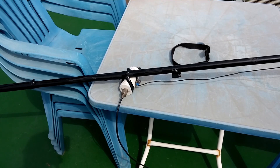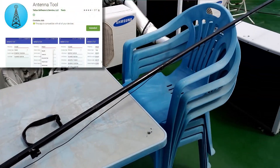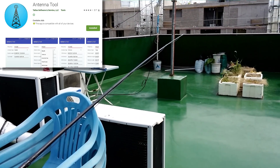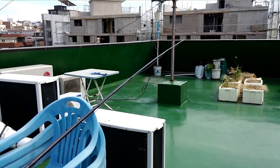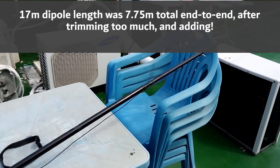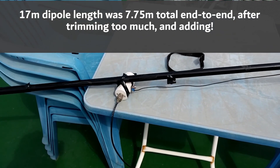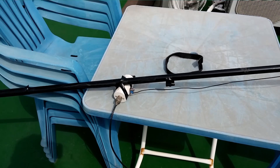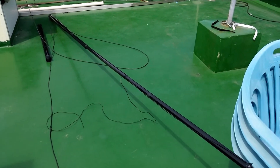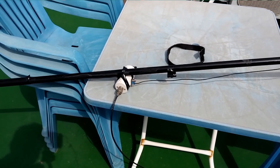What you're looking at here is a one-to-one current balun laying on the table. I took this 17 meter dipole, which I cut using an online application called Antenna Tool — it's an app for your phone. I pulled the 12 meter spider beam HD pole all the way out, taped the dipole at the top with electrical tape about every segment or so, then ran it down to the middle to find where the balun will go, put some wraps of electrical tape around there just for today. Then I plugged the coax in there and the rest of the dipole hangs down, although I have not elongated the pole entirely yet.